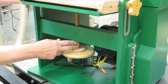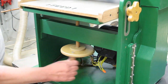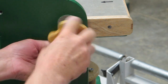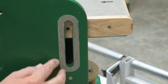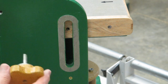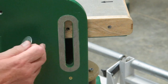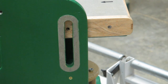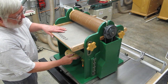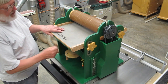This elevating mechanism is a threaded rod that will raise and lower the table very smoothly. I made a piece of Formica and made these elongated washers, glued them to the wood so that the star knobs — which have washers on them — slide up and down without scarring up the paint. When operating this, you loosen the star knobs, elevate the table a little bit, tighten them down again, and take the load off of the screw.